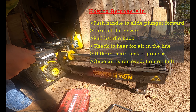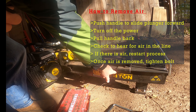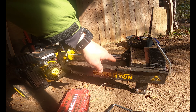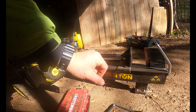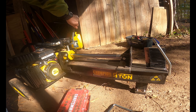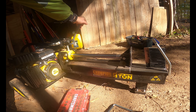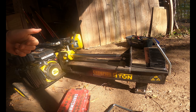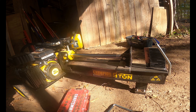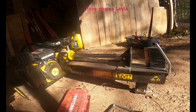Once you have gotten all the air out of the line, re-tighten this brass bolt back up — that's a 10 millimeter. All you need to do is loosen that just slightly with a 10 millimeter, push this all the way out, and then rock the handle backwards to decompress it. Then crank it back up, push this all the way back in, rock the handle forward after you've turned it off, and you should hear the hissing of any air that comes out of the hydraulic lines.